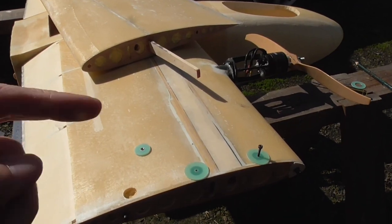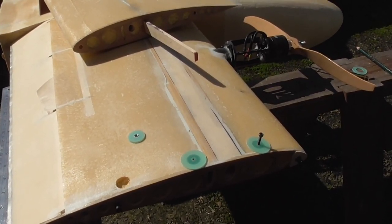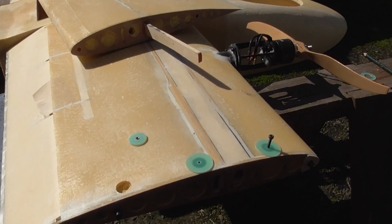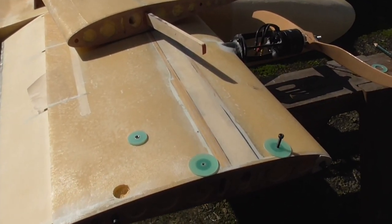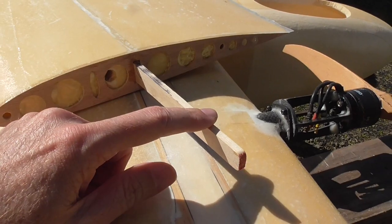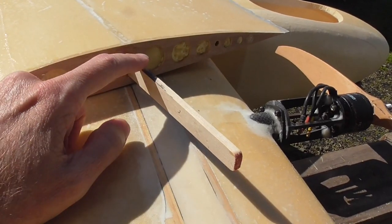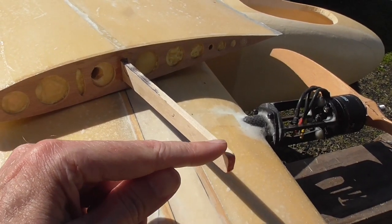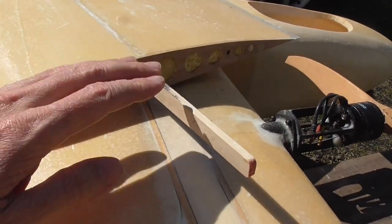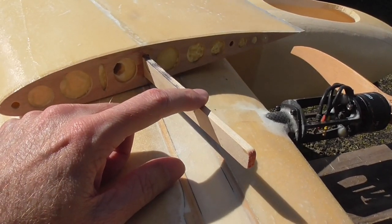It's time to do something about attaching these wing pieces together - and to be honest this is what's been holding up this project. I got stalled trying to figure out a good way to do it, which is why this video has taken so long. There are a whole bunch of ideas swimming around in my head and none of them I really liked, but after a couple of months I figured I'd just better do something. This is the least dislikable solution I could come up with. The issue is that while this prong is quite strong in that direction, it needs to be very securely held in - as soon as it slips out a bit you end up just contacting this corner and that base edge, and I don't think that's going to be very good. I tested it up to 3G but I would rather the whole thing go up to 4G, and I got the feeling it might not quite take a 4G load on its own.